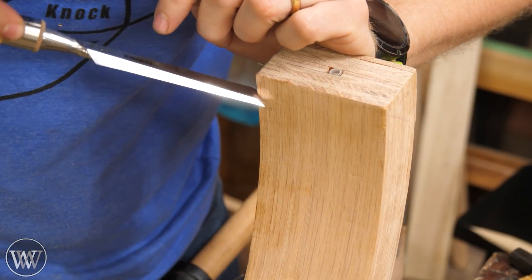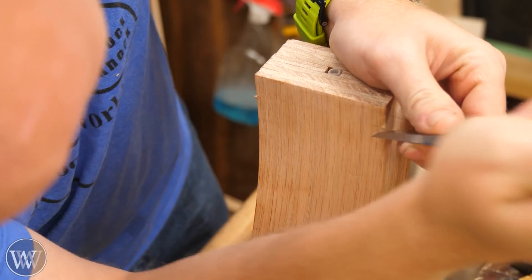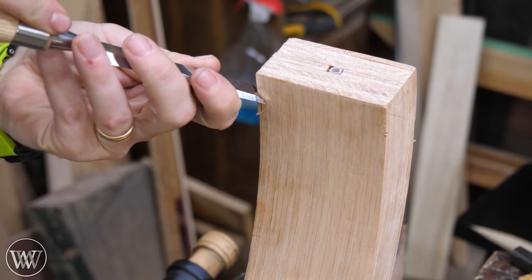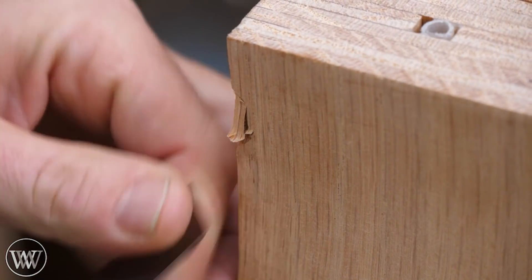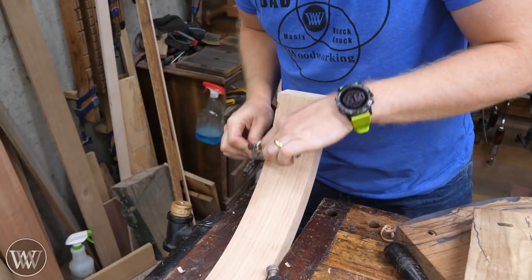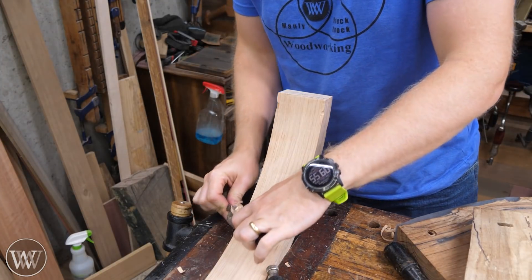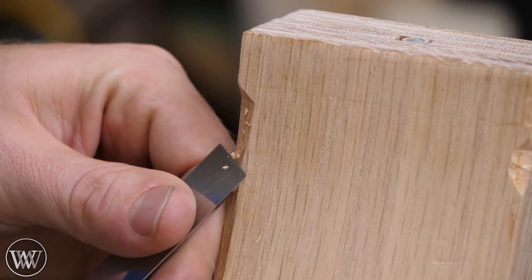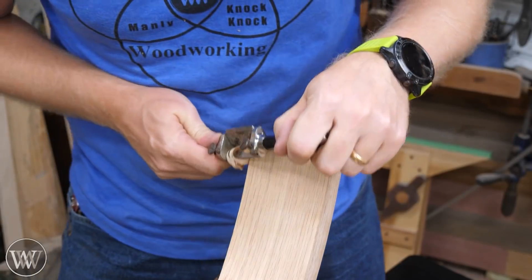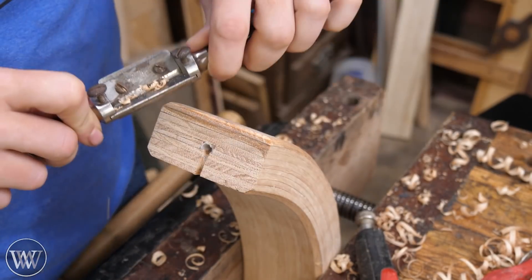Speaking of finish work, let's work on the arches. I want to chamfer all the corners on these arches but I don't want them to chamfer all the way — I want them to stop just before they get to the slab. I have marks on the arches where they intersect with the slab, and I'm going to come a half inch away from that — so there'll be a half inch of sharp corner and then into the chamfer. I'm going to chisel in at the stop point, create my stop chamfer, and then use the spokeshave to put the chamfer on the rest of the board, then feather it in with a chisel and get it nice and clean. The spokeshave actually does really good work on chamfers even on end grain.